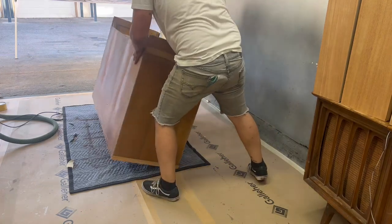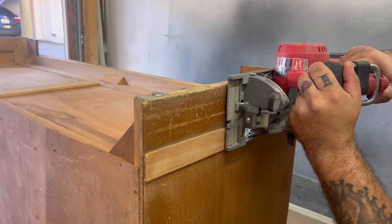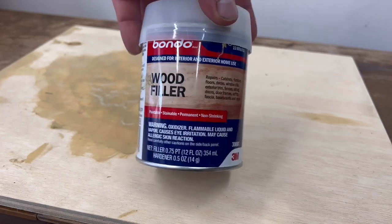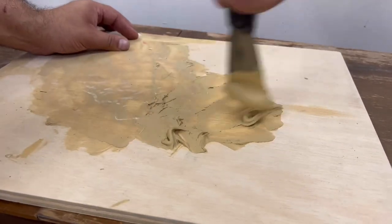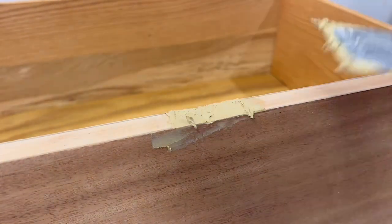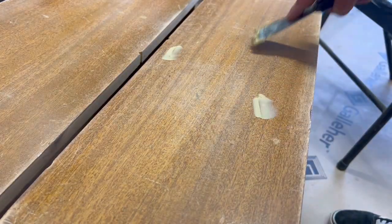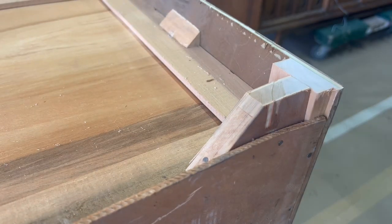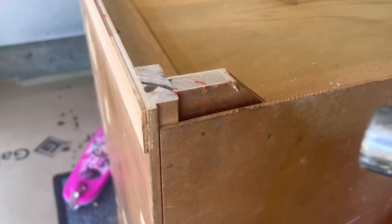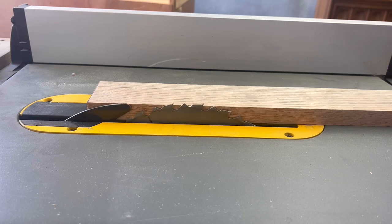I had an idea for this dresser — I didn't like the way the base sat with its two little feet and a flat base. So I'm using my skill saw to cut right at the edge of that thick veneered piece so I can add legs later. I'm mixing up some bondo — it's a two-part wood filler where the red cream is the activator. Without it, it will never harden so you can sand it down. Be careful how much activator you mix in, because the more you add the faster it dries and you won't get much work time. I'm reaching for my hammer to remove a couple of wood pieces that weren't suitable for attaching legs, and I'll cut new pieces so I can put pocket holes in them and give the legs something to screw down to.